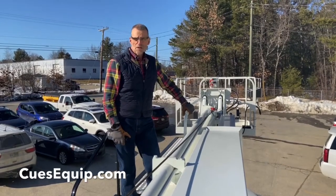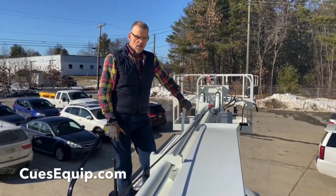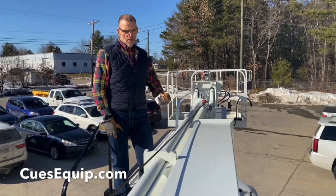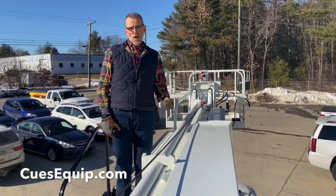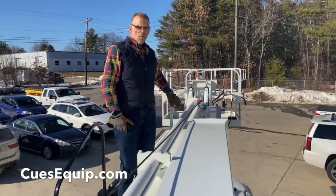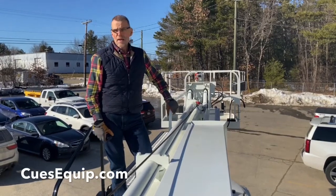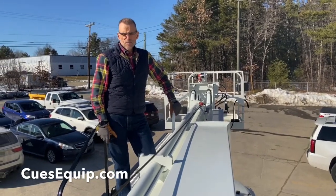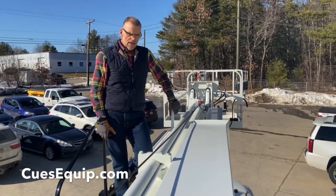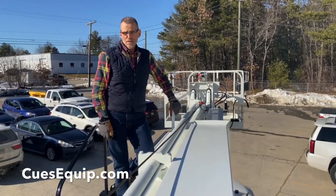This being a new truck, we're not going to run into any problems, but things that you should be aware of on these cables is both the inner core of the cable and the exterior windings of the cable. The inner core nobody sees, nobody thinks of, but it's the part that corrodes and you just don't know that it has corroded. One way to prevent that is to maintain your cable properly. You can do that by keeping it clean and keeping it lubricated. Some manufacturers may recommend intervals at which you should do that. I look at the cable and decide whether it needs to be cleaned and lubed — it's really a visual inspection.